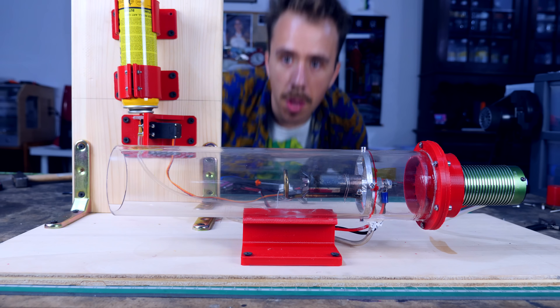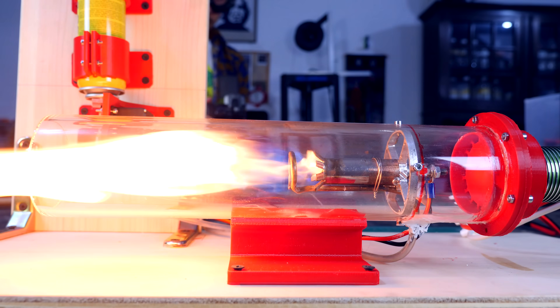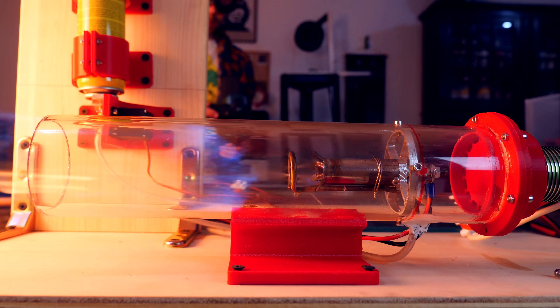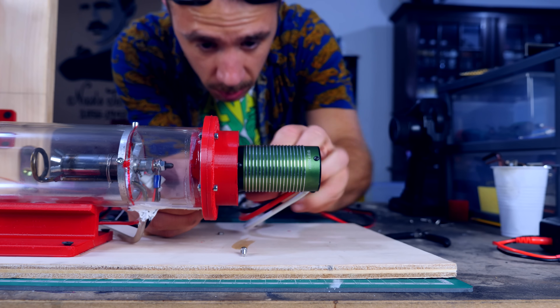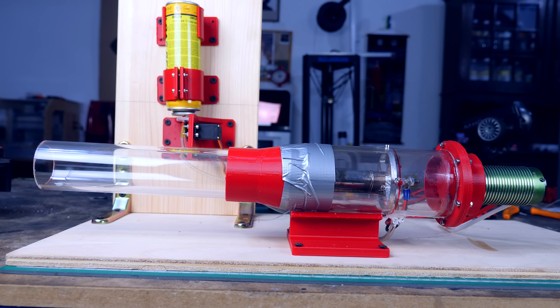First test with the monster motor. That smells so much like propane. Why don't you work? I don't know what's going on. That wasn't working very well, and I got to the reason pretty quickly. This is a centrifugal fan, which means it's not generating fast flow like other fans — it's generating high-pressure flow, which means I needed a constriction. So I cut part of the big acrylic tube and attached a smaller acrylic tube.